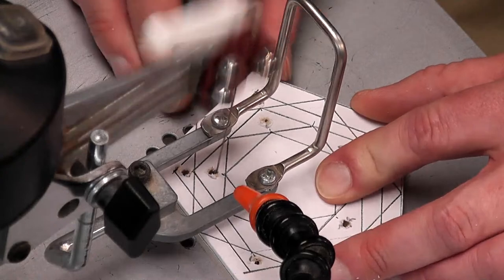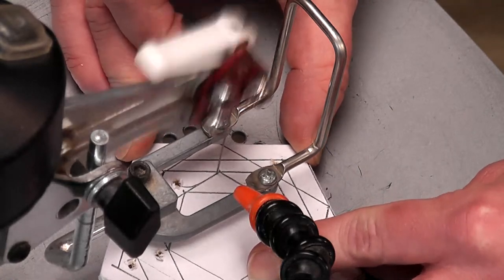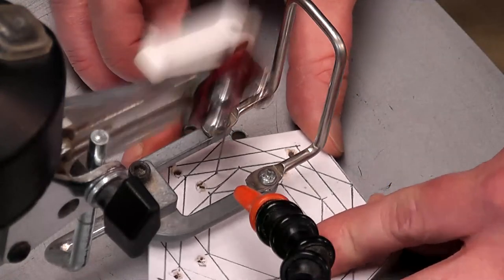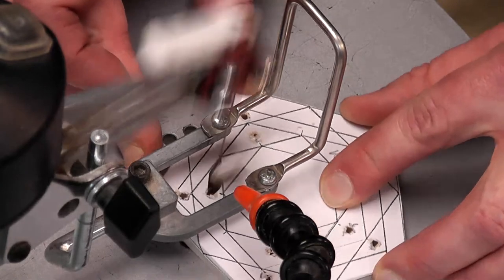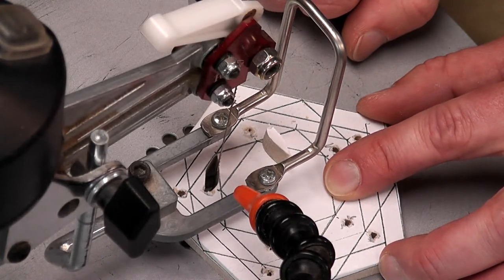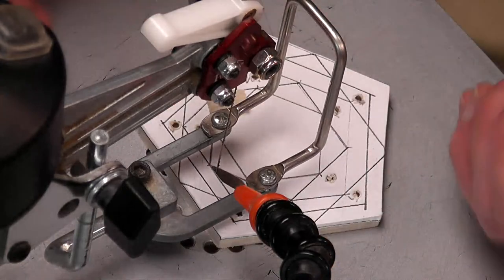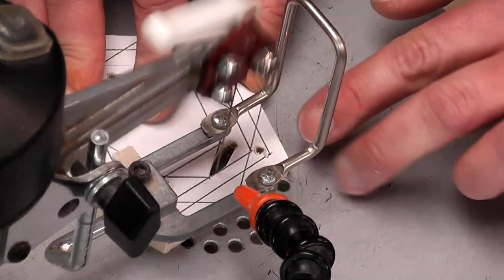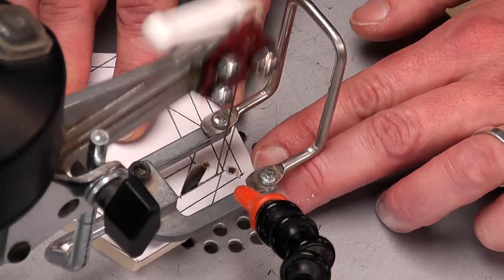The way I'm going to start is to cut down along this line, then back up and cut like a little teardrop shape — coming over to this line now. If you get it right, the blade should just pick that out and throw it up onto the project. Sometimes they drop through into the extraction plate and you'd just have to pick that up and get it out from underneath, because sometimes it will catch on there and pivot on those points. So resting the blade on this side of that line now and just following it, picking up where the other cut finished.